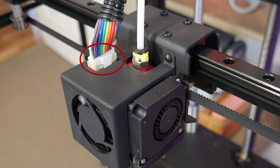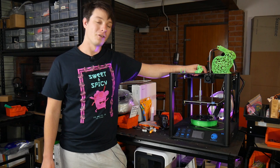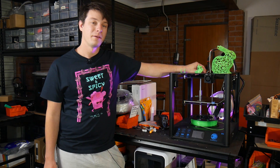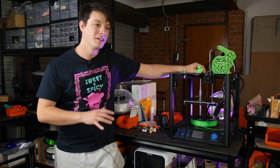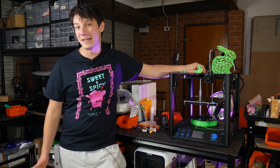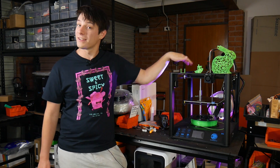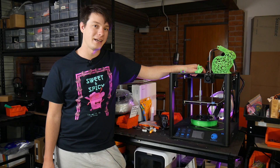I'm currently using quite a large brim on these parts, but they just pull away when you're done. And finally, what about the connector that caused my issues in the first place? I've just hot-glued it in place. Tronxy needs to figure out a better way to do this connector — it needs to be more securely held. Now that the protections are there, it's not so dangerous if it comes free — it's not going to cause a fire if you have the updated firmware. But this connection doesn't really hold with the gantry moving around so much, so they need to update it to something that locks in place better.